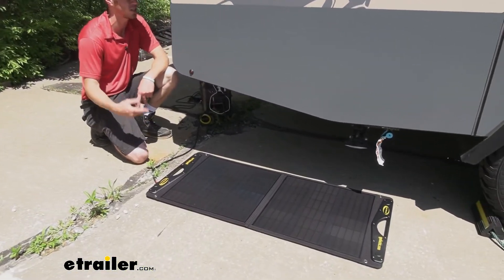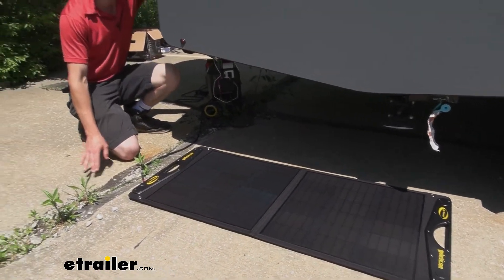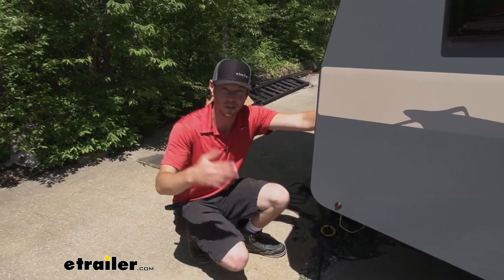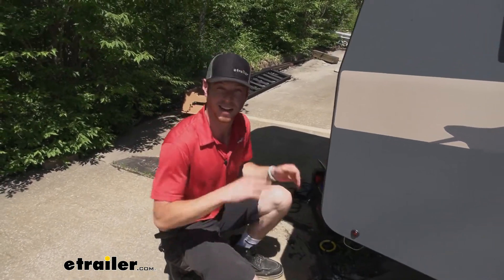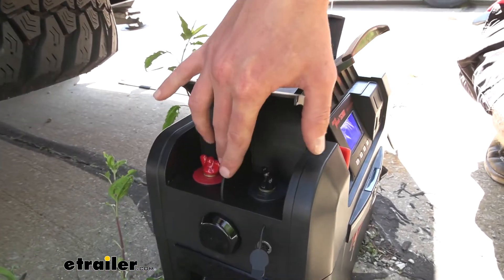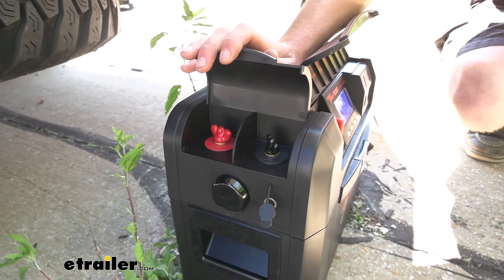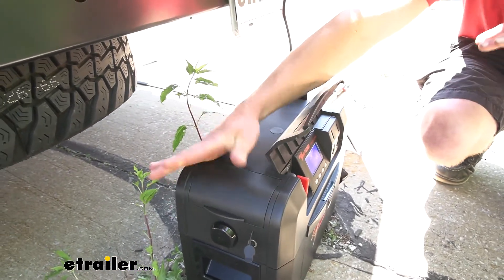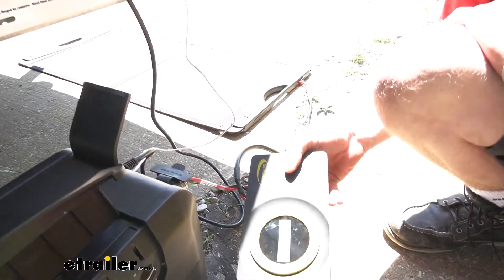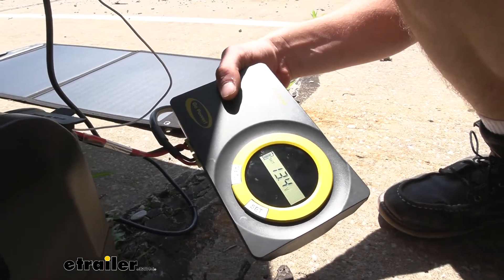The second I plugged the solar panel in, it started charging. We've been charging and running the 40 liter refrigerator, and it's down to about 37 degrees — started at about 80 degrees — and we still have 99% charge. You can also directly connect your solar to the box, but you will need to use a regulator, because all the other three charging methods protect the battery from overcharge. If you use the direct line, make sure you use some sort of regulator so it doesn't pump too much juice to your battery.